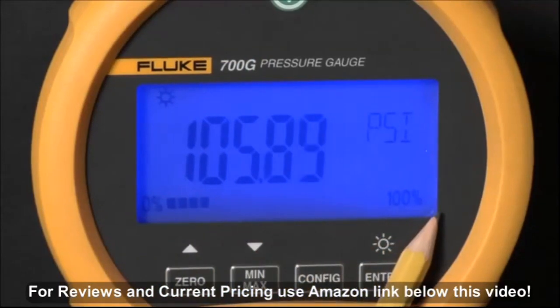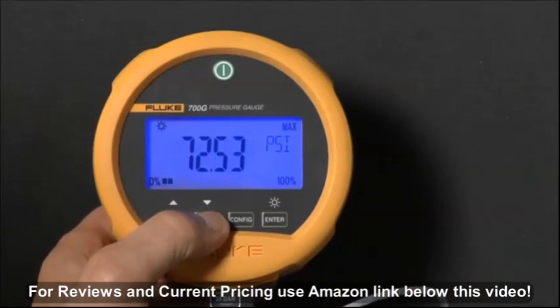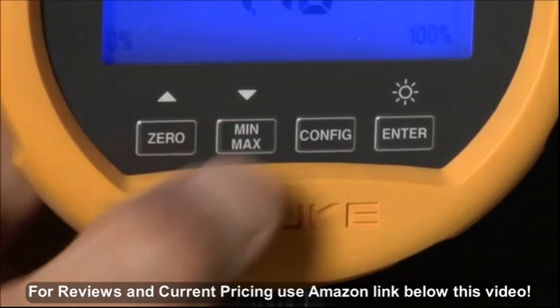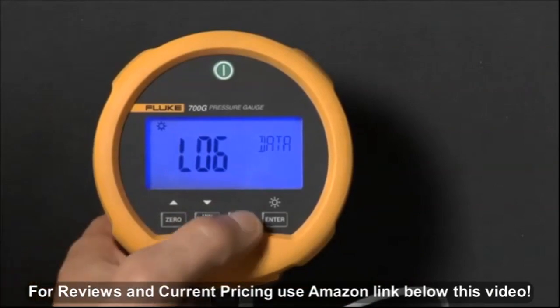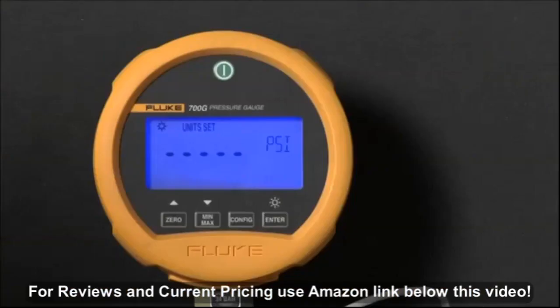The gauge constantly records minimum and maximum measurements. To recall the measurements, press the Min-Max button to toggle from minimum to maximum. To configure the gauge for use, press the Config button. Each time you press Config, you get a new configuration option. Press the Enter button at any time to exit the configuration mode.